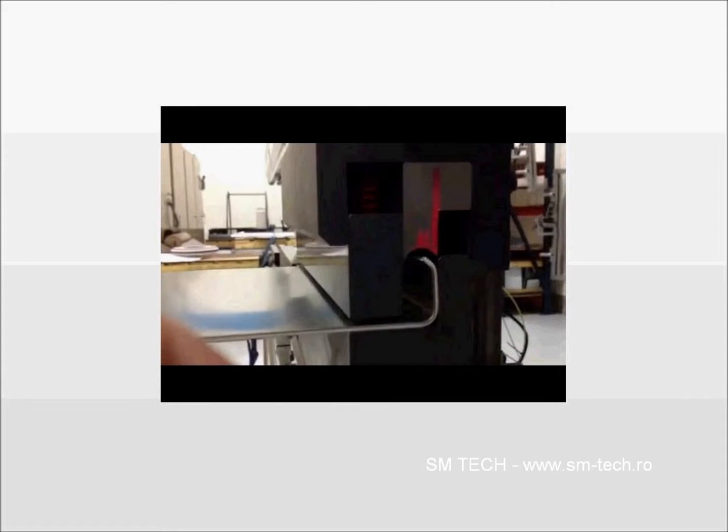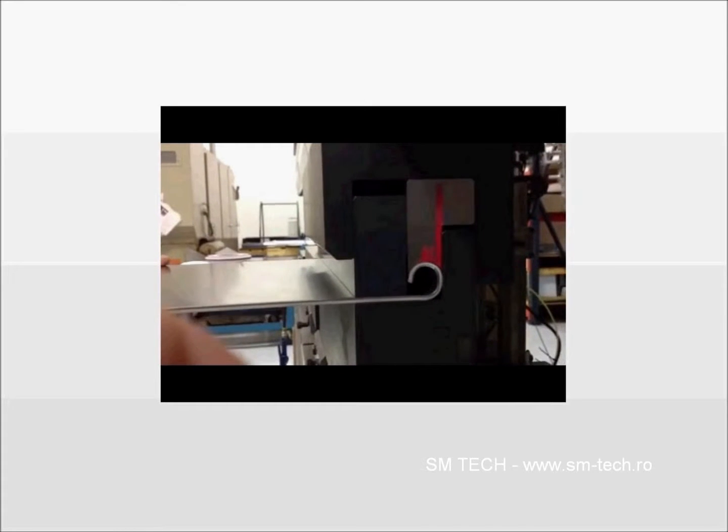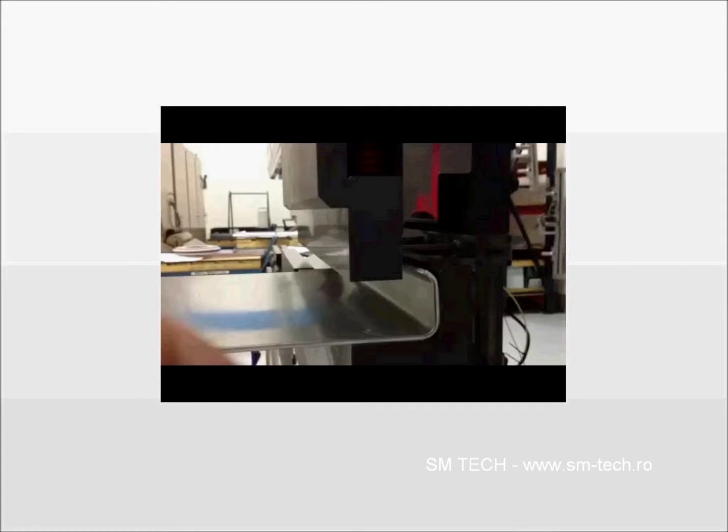So there you have your form made, so it's ready to be curled over now. And I'm going to show you that one more time because people like to see this curl over. This is where heat treat becomes important in a tool as well, because as this flange on the top that's on the end of the bend curls over, it's also scraping inside the tool. So if you make a tool like this and it's not heat treated properly, you probably won't get real good wear life or repeatability out of it.